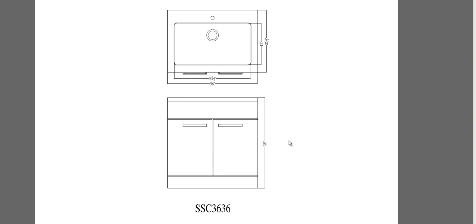So that said, what we're going to probably want to do is take 36 inches, the total height, then subtract the actual thickness of the countertop. Now, most people using 3 centimeter thick stone are going to have 1.25 inches, or a 3 centimeter thick countertop. So your cabinet height needs to be somewhere around 34.75 of an inch. So from the bottom of the cabinet to the top of the cabinet that you'd be ordering would be 34.75, and hopefully that would match up just fine.